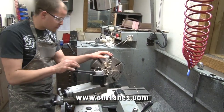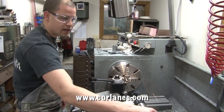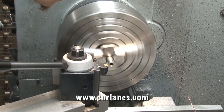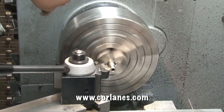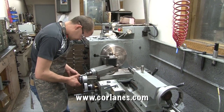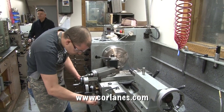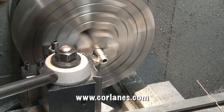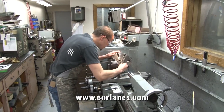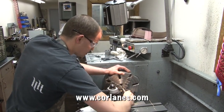Alright, we're all ready to thread now. I've cut a small recess for the threads to stop in. We've got our brake — half-inch 28 TPI — and we'll check that as our progress goes. So now we're starting to get nice tight threads.